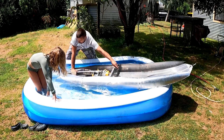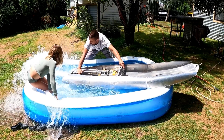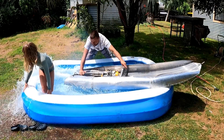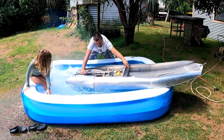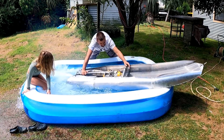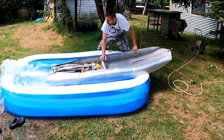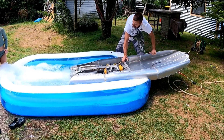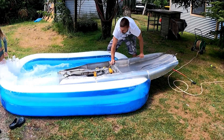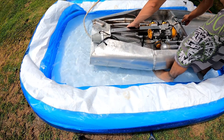After reviewing the footage, we've got a heap of thrust when it first started up. It sounded like both motors were going, but I don't think they were going properly. Then you hear one motor rev up — I think that's the rear motor — and that's when the coupling let go. I think the whole time it was dragging on the front motor only. Running on one motor it still had a bit of thrust, but I really need to test it again with both motors running properly. Even still, I think the impeller pitch might be too steep.